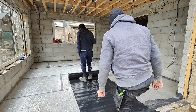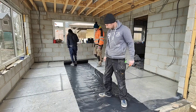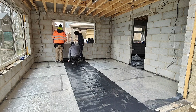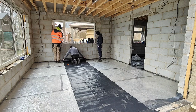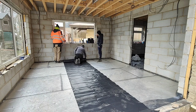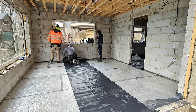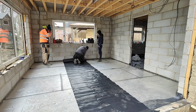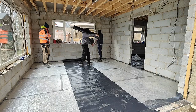So that's it - we've got all the Kingspan down. We're just putting the last layer of visqueen on top. All joints are taped. We had a couple of boards that were still wobbling about because the boards were actually seconds - they were slightly out, five mil between some of them, and had a bit of a rock on them. So I basically got about seven tubes of expanding foam, just foamed it all out, left it a day, cut it off, then taped it all up. Now it's a really solid floor - no movement at all.